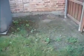Foundation inspection. We've got a little bit of erosion here. It's caused by runoff. What's actually happening is this roof here is shedding water onto here, and it's just flooding down and it's overrunning the gutter. That would easily be solved by putting a gutter diverter up there just to stop the water coming down here. You can see it's hitting the grade here, splashing up on the foundation itself.